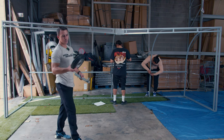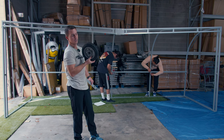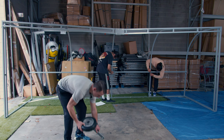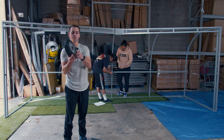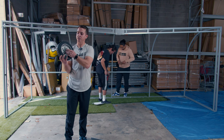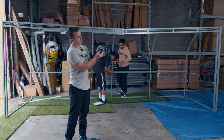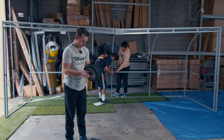What you're gonna have on this wheel kit is this big wheel. When you put it together, you want the head of the bolt on the outside, facing outside. So this will be your outside. With this wheel come these two bearing inserts. So here's your bearing, and we'll slide this insert here on the inside, right into this hole. We'll take the other side, and you'll slide it right through. And now the wheel turns on the bearing.